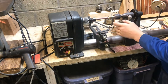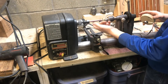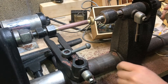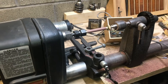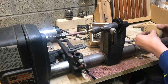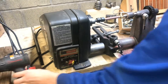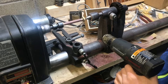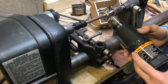This is one of my favorite parts - whenever you apply heat to the wood to actually bring the purple back out. You can see this is not really looking that purple anymore. The little dust down here is pretty purple, but this almost has like a brownish-reddish to it. I like the deep purple, so let's go ahead and turn this on to a lower speed. Then we'll take a heat gun like this, turn it on, and slowly apply the heat to the wood, and you'll watch the purple actually come into the wood.